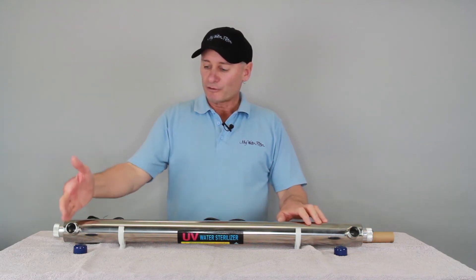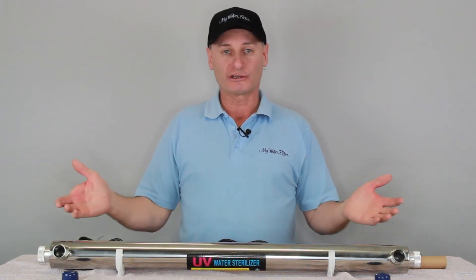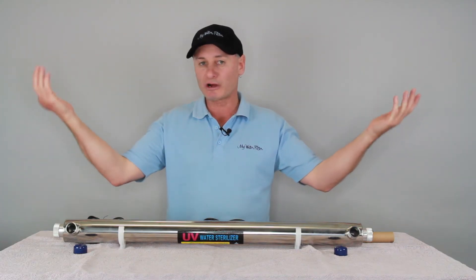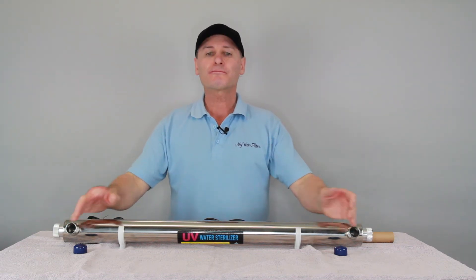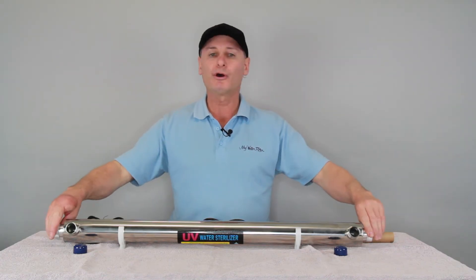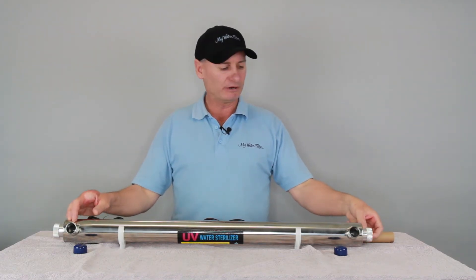When you're on the property setting this up, we're now going to connect the pipe in and out onto these one-inch BSP threads. At that point we can turn the water on and run the water through this thing. Sleeves inside, two nuts are up tight, O-rings are on, it's all locked up tight, it's fixed on the wall. Connect the two pipes — in this way, out that way, doesn't matter, it's only water — and it's just going to travel from one end to the other and the water will be sterilised and the bugs will be gone. Connect your water on and then turn the pump on. Flush the toilet, turn the taps on, give it a bit of a shock, make sure it's working. We're checking for leaks. We haven't put the globe in, we haven't turned the electricity on — all we've done is put the quartz in. Quartz is in, we've pumped water through it, there's no leaks, we're really happy, it's working well.